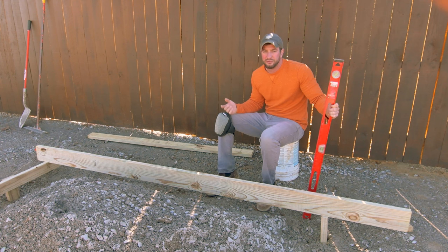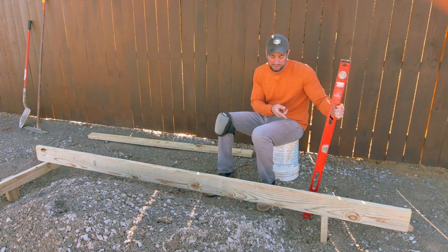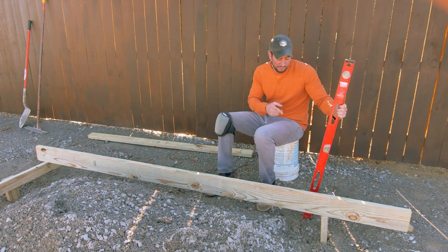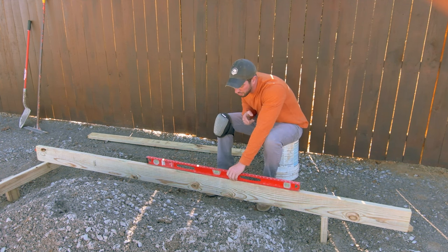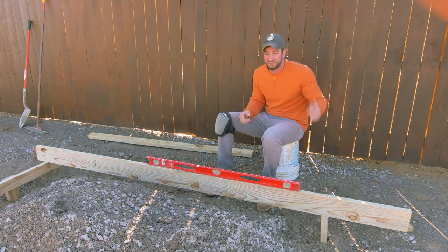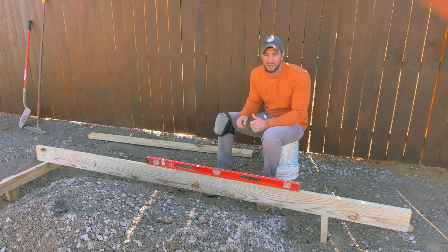You've got your first screed rail leveled, now we want to set up our second screed rail. To do so, we want to level the two to each other. First, we pulled an eight-foot approximate measurement to get to our first stake. Then we took our two-by-six screed board, set it on top of the stake as we hammered it down, and we use our level — the key point here is to level the two together. We use our four-foot level and hammer this first stake lower than approximate level, because we want the stake lower than the screed rails so it makes it nice and smooth when running the screed board across the top of your rails.